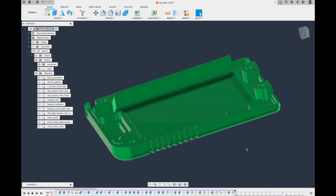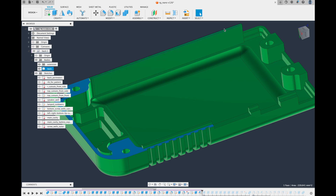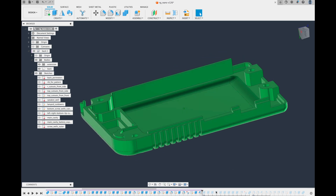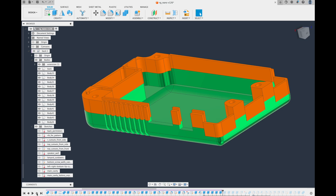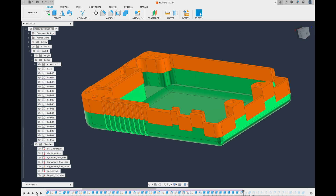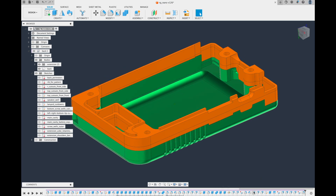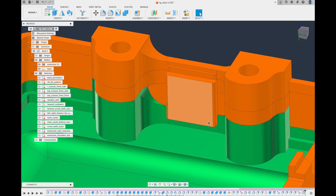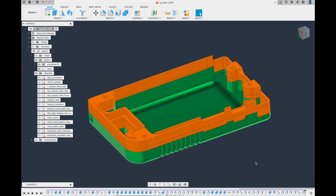This is the other part I think is kind of cool — though I realized I haven't tested it, so I'm going to test it right now. I took all these flat planar faces and extended them out by a value — in this case five millimeters, basically doubling the width for the battery. That is a parameter that can be adjusted to whatever you want — eight, ten, whatever. Towards the end of the timeline there's some spaghetti going on, just tolerances and little tweaks as I printed and needed to fit things, like adding a small retaining lip.